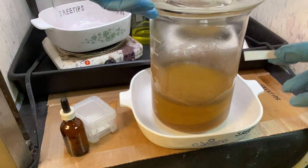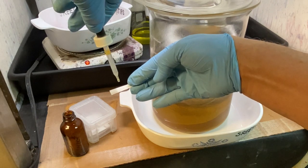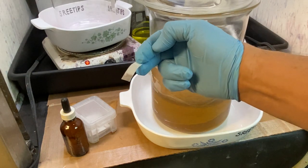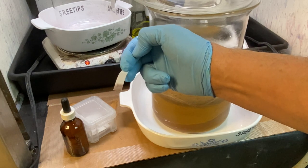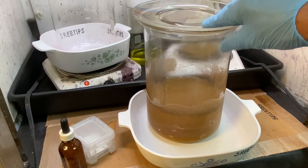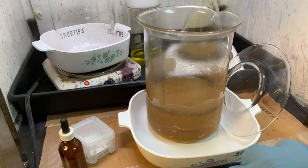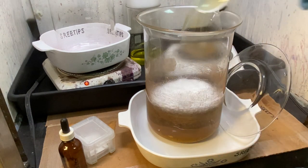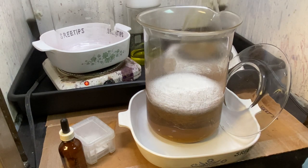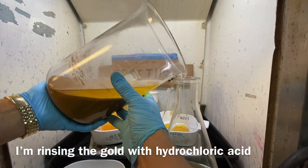I've got a piece of filter paper here — I'm going to reach down in and get some of the solution on my filter paper. I'm going to do a stannous chloride test here to see if we still got gold in solution. And as you can see by that stain, not very much, but we need to keep adding sodium metabisulfite to get the rest of the gold to drop out. Let's add a few more spoons of SMB to try to get the rest of the gold to drop out. It shouldn't take too much more to get it all to come out of solution. If I had to do this over again, I would dilute the solution before I try to precipitate it.